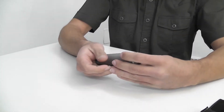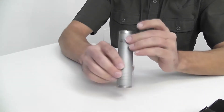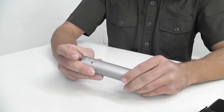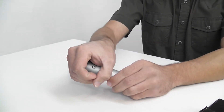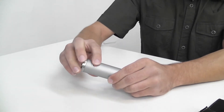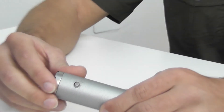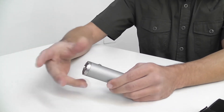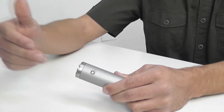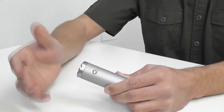If you would like to manually activate your mod, all you have to do is unscrew the end cap a little bit, place your finger on the button and then screw in your end cap again. It will no longer flash blue all the time — it will simply stay off until you press it. Also in manual mode, you can check the level of your battery by tapping it once short and it will blink back to you: green for over 50%, blue for under 50%, and bright red for under 25%.